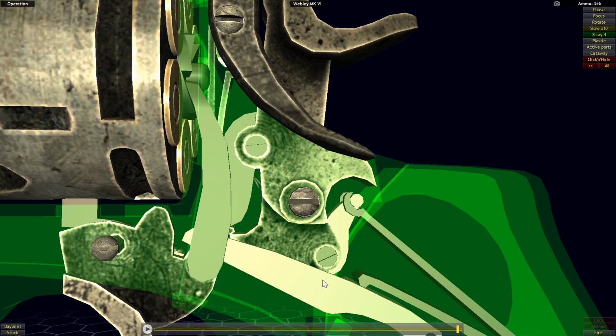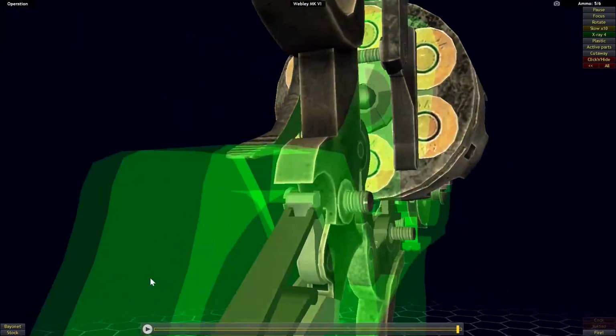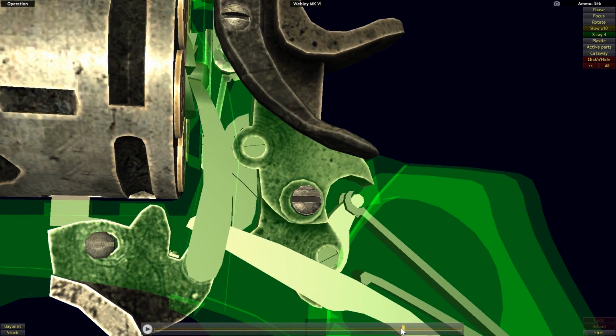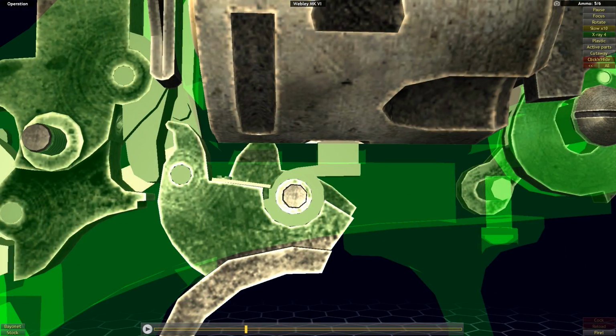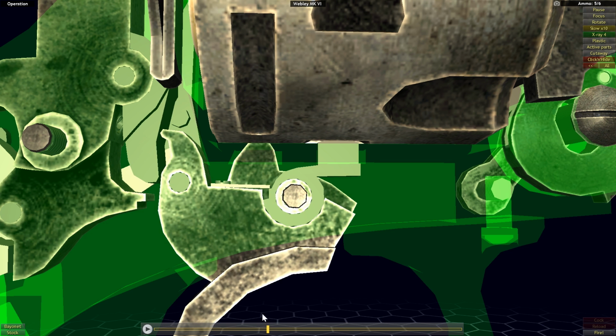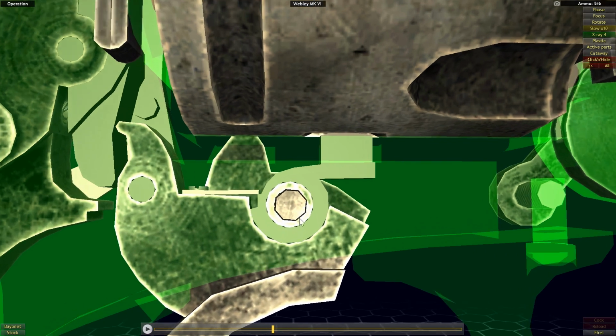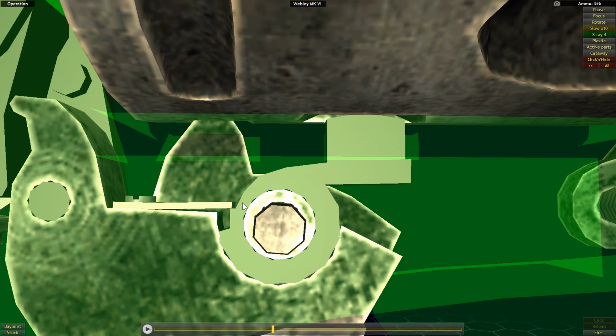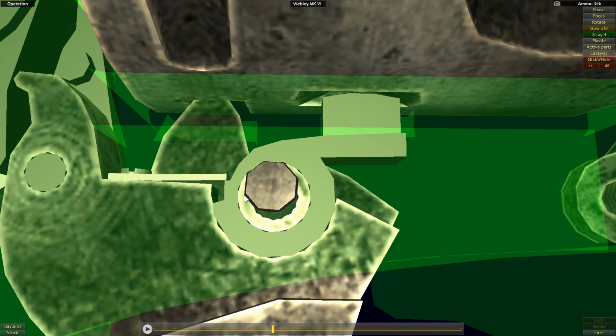And again, you are going to have to forgive the animation and its poor timing in that regard, and just imagine that that lever moved along with the trigger and the hand. For the return of the cylinder stop, as the trigger is released and the lever forces the trigger to pivot back around, the cylinder stop is not going to move. It's pretty much going to stay in its current position because as it's being pushed down by the flat spring here, it can't really go any further up because it's already in the locking notch.